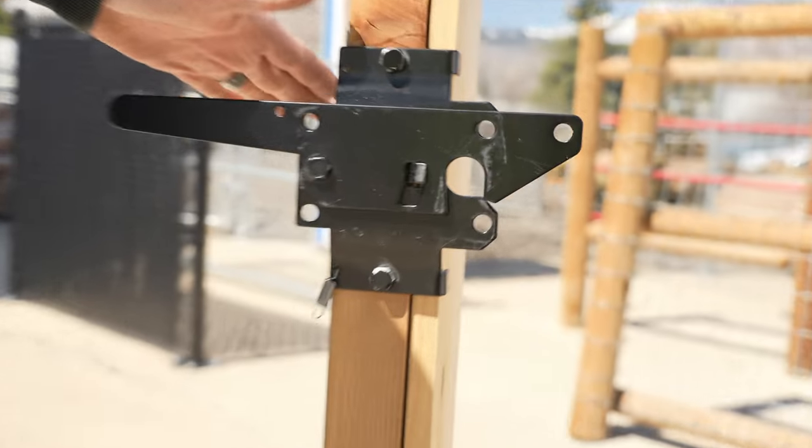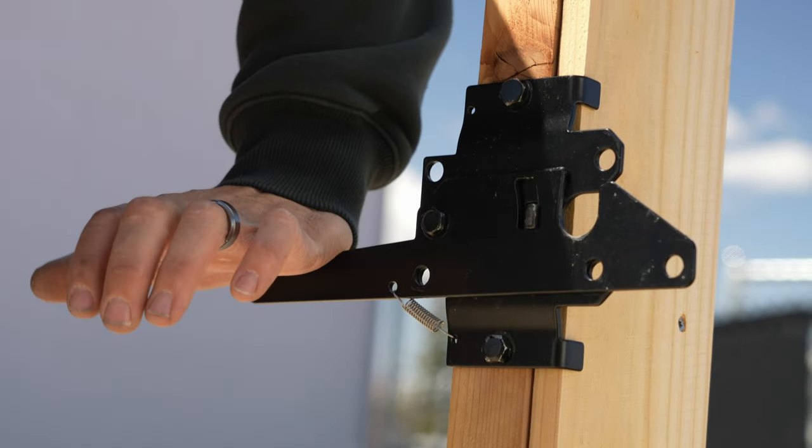There's only one way to put a latch on — the peg goes on the gate. Working with family is fun. We can have this debate. You can install the latch one way — so you pull down to open it. One way you pull down on the latch and it opens the gate. The other way you pull down and it does nothing — you have to go up on the latch. You can pull the screws and flip the latch over, and it's an up motion, so Fido can't hit that. Yeah, there's two ways.